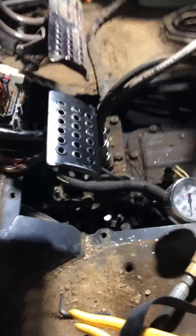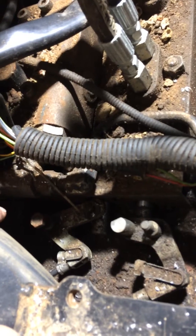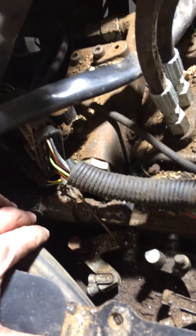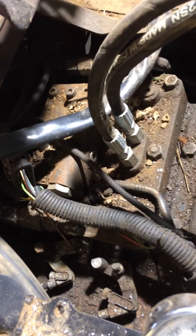I got to wondering what in the world happened, because this tractor already burned up the clutches that quick. If you've never seen how these things work, it's actually a pretty intelligent design. You have hydraulics that come through - you don't have a regular clutch like in older tractors that disconnected the transmission from the back of the engine. It comes through a damper and in front of the transmission, then hydraulic pressure feeds through this valve block right here, then through your forward/reverse spool, which is up here. When that feeds through, it pressurizes the clutch pistons and engages or disengages based on your foot pedals and forward/reverse.